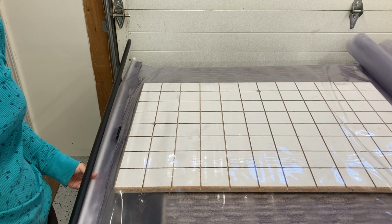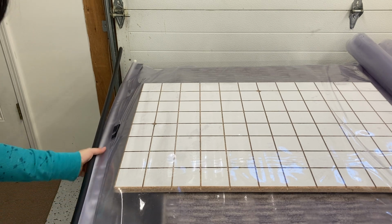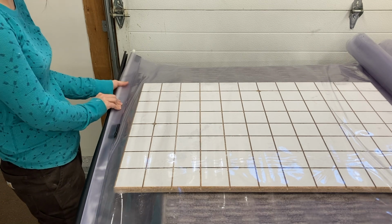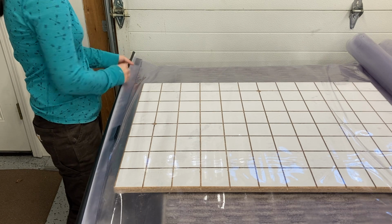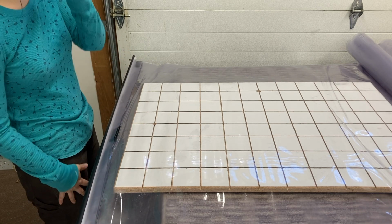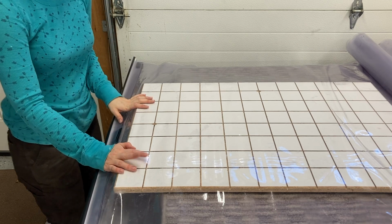Now I'm going to put on the C-clamp closure. And this is kind of like a glue up where if you start snugging it on both ends simultaneously, you usually end up with air bubbles or wrinkles in the bag. So start from one end, go to the other, or start from the center, go to the other. And now I'm going to pull a vacuum.